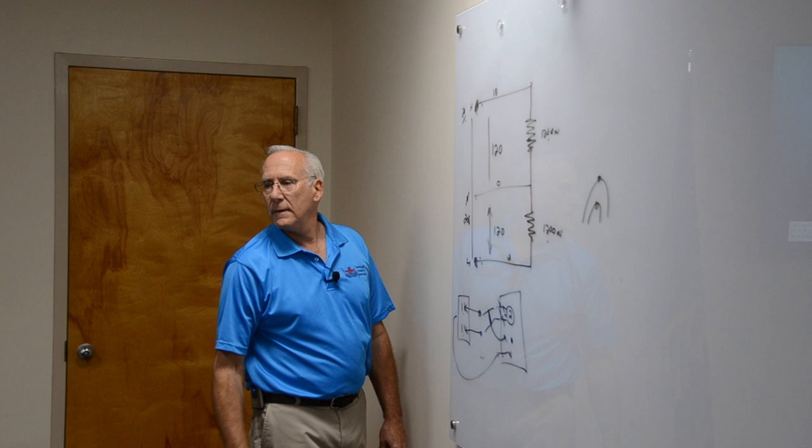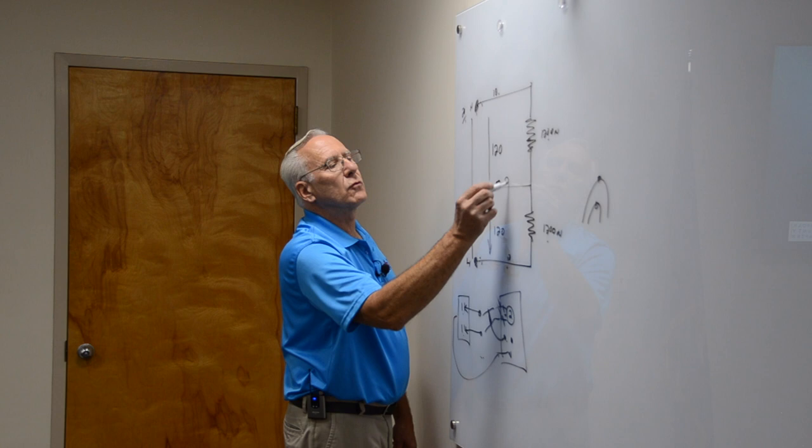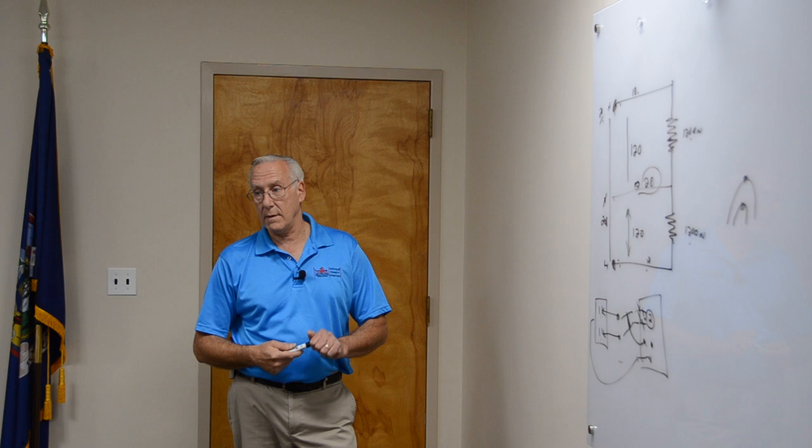Okay, so what happens to neutral current? Instead of being zero, because 10 high, 10 low, 10 minus 10 equals zero, now the neutral current is 20. If these two are on the same phase, the neutral current is 20, burn up the neutral. Seen it 100 times. I'm telling you, I've been in this business a long time.